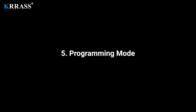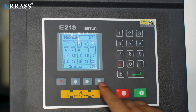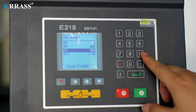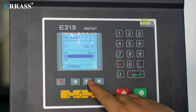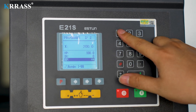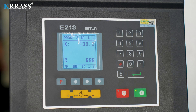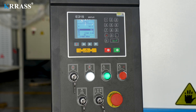5. Programming Mode. After the shearing machine enters the standby state, continuously click the P key of the controller to enter the program interface. Select a blank program and click the Confirm button to enter the editing state. Enter the ST, PP, and DLY values of the program in sequence. By clicking the right button, you can edit each step. After editing, switch to the first step and click the green start button. If you want to work continuously, just select the conversion button on the control panel.